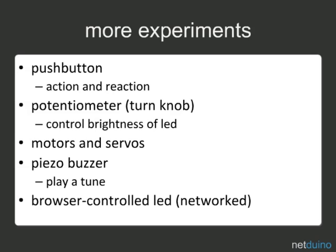We talk about servos, which is more interesting because now you can move things to certain positions. If you had a sign that you wanted to turn, or a plasma lift, or that window in the back of a car, for instance, you wanted to go to a certain position, well, a servo gets you what's called a feedback loop. You know where that servo's at, and you simply use a pulse signal, and you don't have to sit there, 10,000 times a second pulsing that signal and changing the length of that signal so it knows what position to go to. You just write one line of code, and it just starts moving. It's really simple to implement.